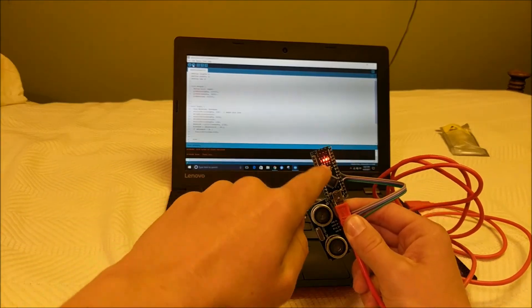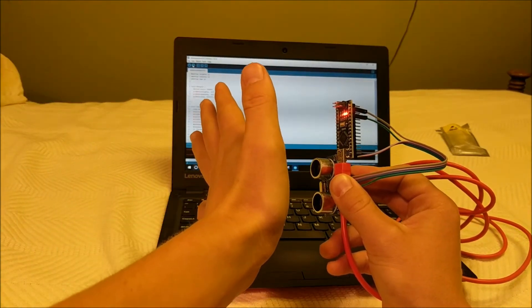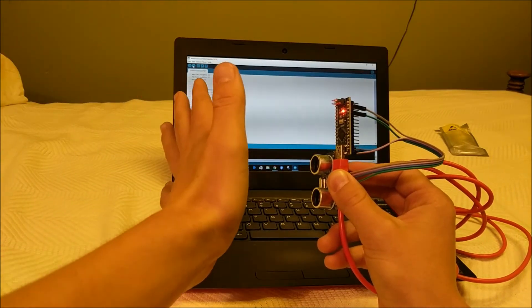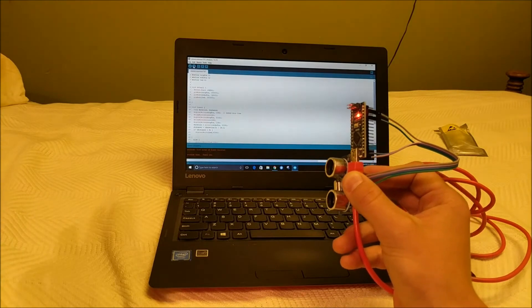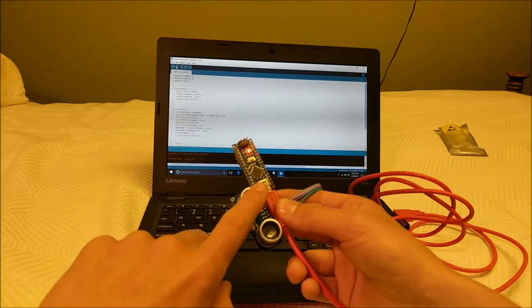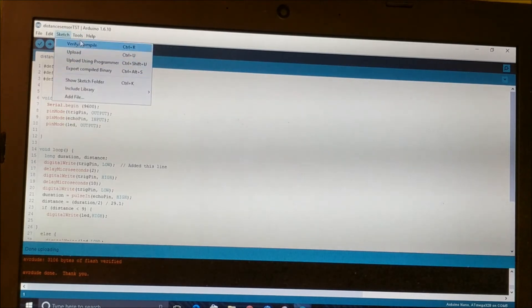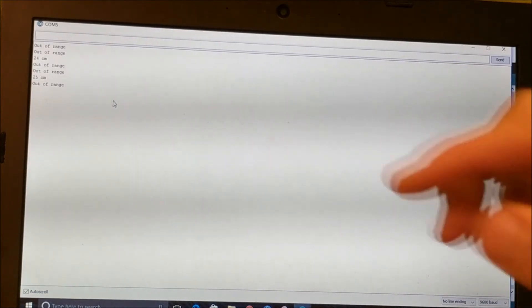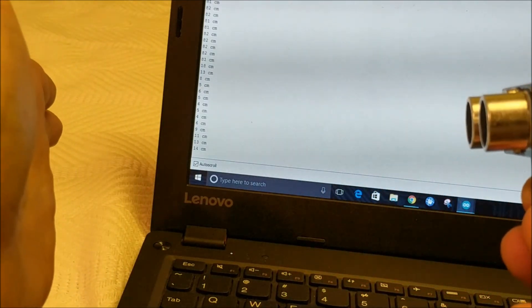As you can see, there is no light on for pin 13 of the Arduino — just the TX pin, because it's transmitting data to the serial monitor. But as I move my hand closer, the light turns on on pin 13, and it turns off when I move my hand away. That means this Arduino distance sensor is working. As I move my hand closer and farther, it changes the state of the pin 13 LED. We can see the actual values in the serial monitor — as I move my hand closer and farther from the sensor, the distance changes. When I move it farther, it gets larger and larger, and eventually it reports out of range as an extraneous value.